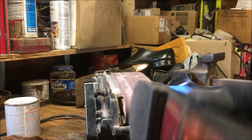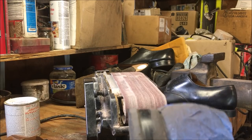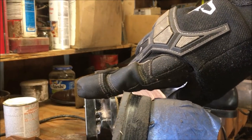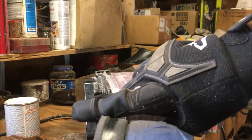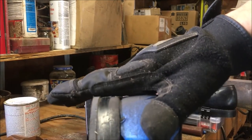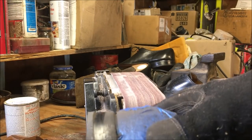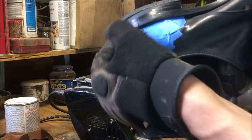Here's another tip. When you're sanding, the angle at which I hold this, okay, is really critical. If the belt is here, and I have the shoe like this, it's gonna create an angle, and then this part and this part will not be parallel, and it will look funny, and you'll get waves as you go around, okay? So it's really critical what angle you hold this. And if you hold it here, you're probably gonna sand something you don't want to, so you gotta get it perpendicular. What I'm doing here is I'm using that span, because I want it to flex to get that curve.